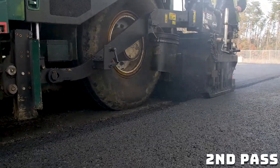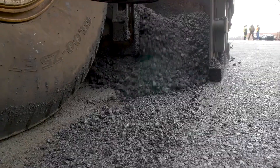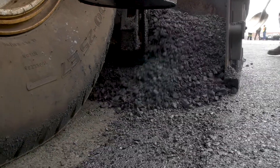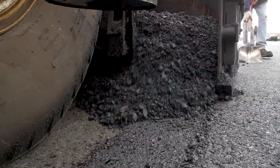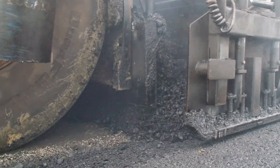Your physical joint would be the same location — it's just our wedge would be 12 inches farther out. Normally we're very, very close to joint density matching the middle of the mat. When we start to get a thinner lift, a lot of times our joint densities actually end up being a few tenths higher than the middle of the mat.